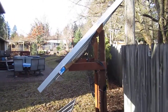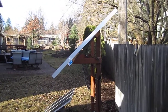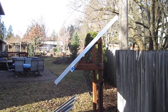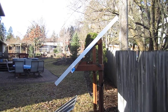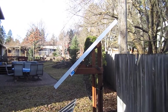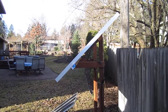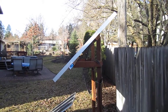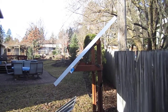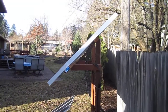In the Northwest, our sunshine is very high in the sky in the summer and very low in the winter. So a variable rack would be ideal — you'd want basically 60 degrees angle in the winter and 30 degrees in the summer, because it goes straight overhead most of the time during the summer. But this is more of a portable system. The backyard serves its purpose as a backup with grid-tie capability, so I keep it at 45 degrees, and that seems to work fine.